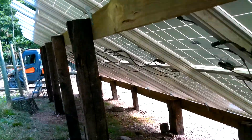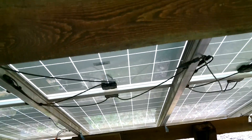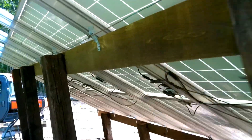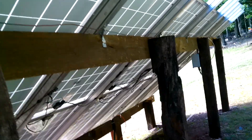I've got everything redone. I still need to put an outlet — I need to run a wire down for that. There's my junction box where all my home runs go into. I have two clear taps in there that run the cable down to a DC circuit breaker and then into the inverter. One thing I noticed — I'm not going to say anything yet — but I need to test all those circuit breakers and panels individually, and I'm probably not going to do that until spring.